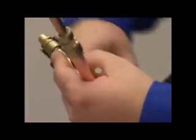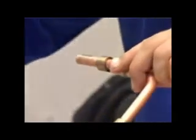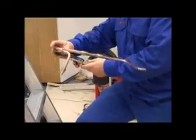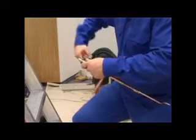One more time. The lock prep solution is applied all around the tube end. The compression ring is placed on the tube. The connector fitting is pushed onto the tube end and turned to help spread the lock prep solution. The compression ring is brought up to the connector and, making sure the tube is pushed hard into the connector, the fitting is again compressed using the lock tool.